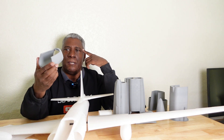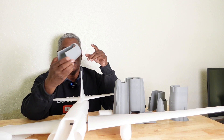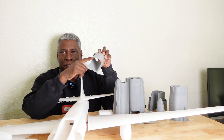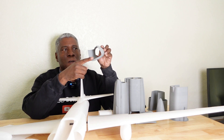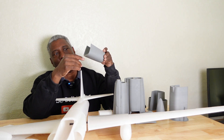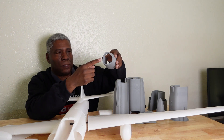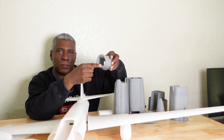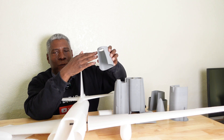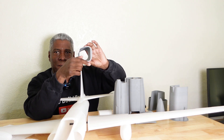This is the first section here. Down here it's heavier on the bottom. To shell this out, after you cut this while it's still one piece, you would draw the shape back here and also on the front, and use a loft cut to cut that through there. You put your guide rails on the side as well - however you want this side to be shaped - to get the shape like that in here.